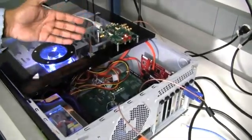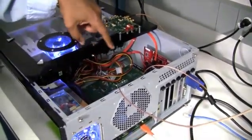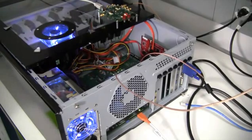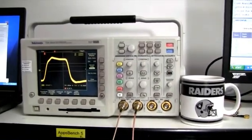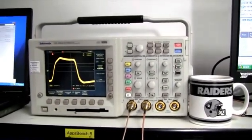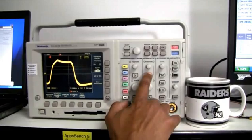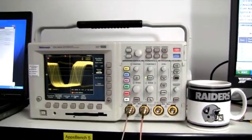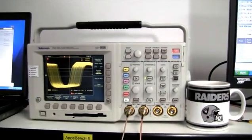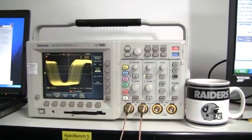Here we have a clock synthesizer chip, in which we're now going to create a 100 MHz spread spectrum clock and inject it into our actual expansion chassis. Over here we'll take a look at the scope and see what that looks like. Here's the clock that we have going into this system. I'm going to show you a real easy way to try to determine whether or not you have spread spectrum enabled on a system. When you have a clock, if you take the delay and expand it, you can tell whether or not spread is occurring. As you can see from the scope, this system is definitely a spread spectrum clock system. I'll next change these clocks and show you what the clock on the other side also looks like.